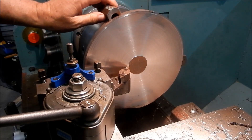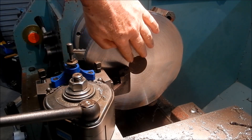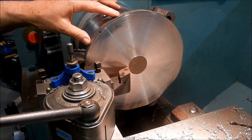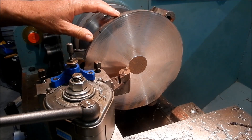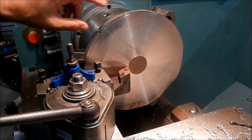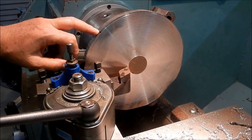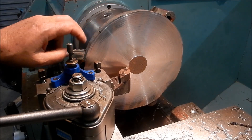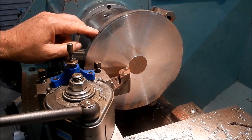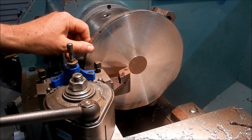That's not too bad. I'm just going to take a little nick on the OD here to see how that's going to clean up and whether we'll get that cut cleaned up as well. I might need to put a tooth there, but the issue is this area is going to be reasonably hard from the lance going through, so I may have to get in there with a file first to remove some of that hardened material.